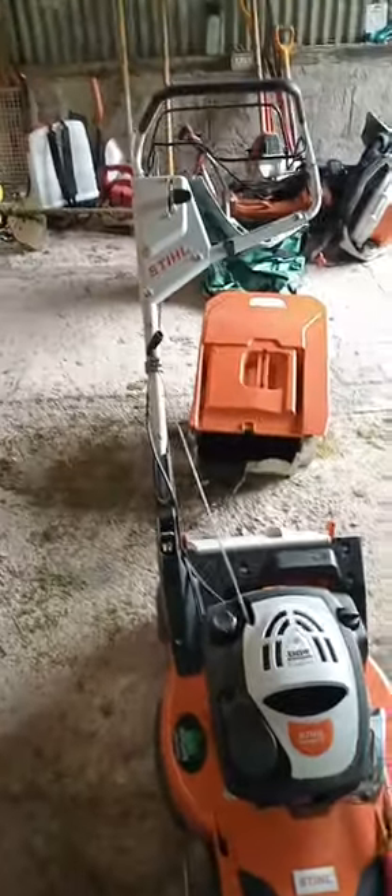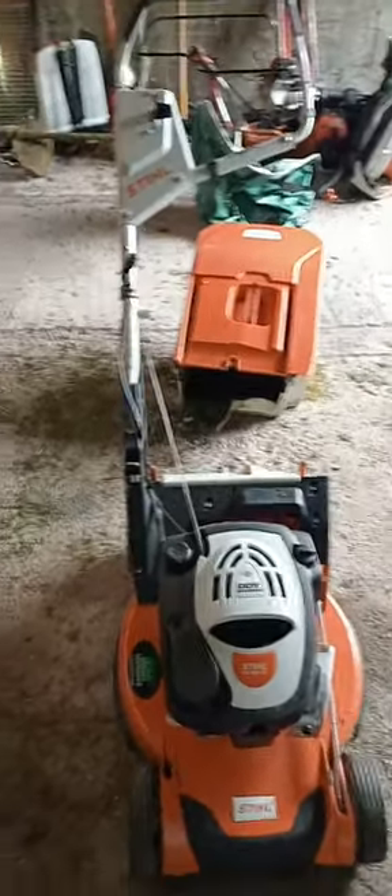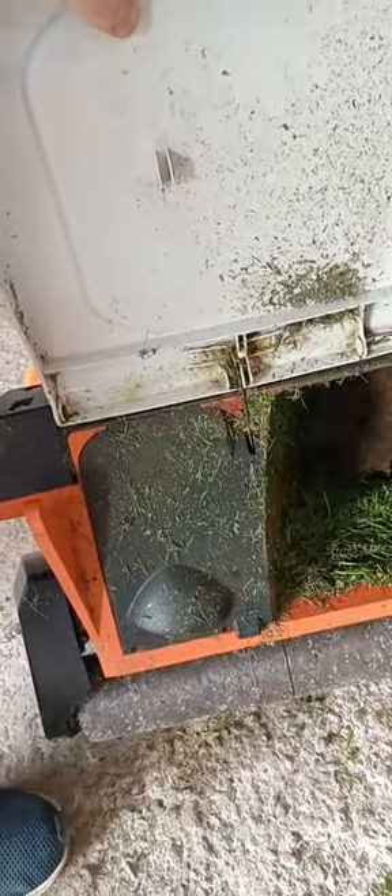Moving on to the rear roller. You've got a metal steel rear roller - it's a dual split rear roller. It has no grip in the wet whatsoever - it is quite poor in the wet. That's a major gripe with this machine as I cut in varying weather conditions. It doesn't have the grip that a four-wheeler or a ribbed rear roller would have like on the 5 series. It is a smooth roller - not ribbed, no pattern on it. However, because it's a dual split rear roller it does aid with turning, making turning a lot easier.